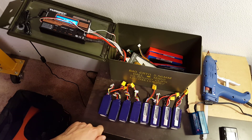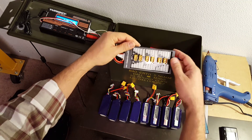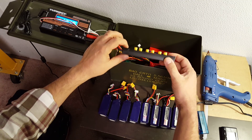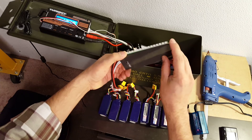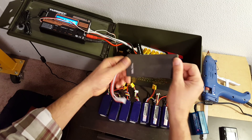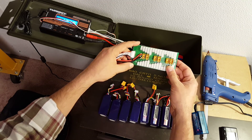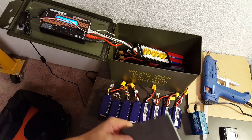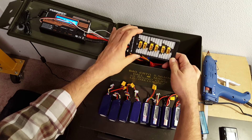What can you do to help keep this safe? There are a couple of guidelines. First of all, you want to get a quality parallel charging board. I like the fact that this one has a plastic case. There's another one that is a bare circuit board with some coating on the back — that's probably fine, but it's a little sketchy. Some boards even have fuses built in that will pop if you get a short or excess current flow. That's not a bad idea.